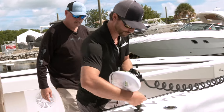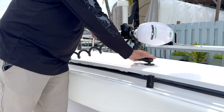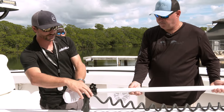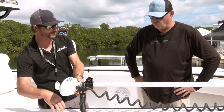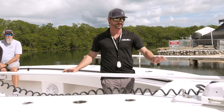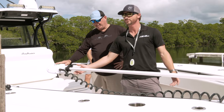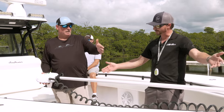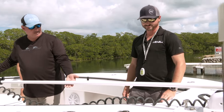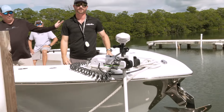With this swiveling mount, you simply undo the lock — this is just a ram mount. There's no locking position on the mount because all these trolling motors need some kind of ram mount or support, since when you're running it's going to bounce everywhere. We utilize these mounts to hold it in the stowed position. You remove the mount, pull up on the pin, twist it, and it automatically falls into the deployed position. If you were to just permanently mount it there, you'd be stuck with it hanging inside your boat and you'd lose your rod holders and all that space. But with the Sea Swivel, you just put your hand down, put it in the water, and you're ready to get spot-locked — all without leaving the safety of the deck.